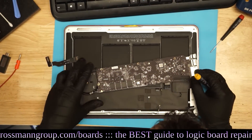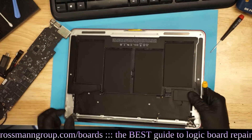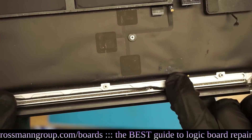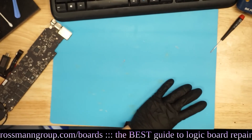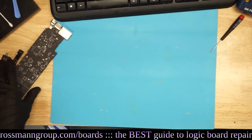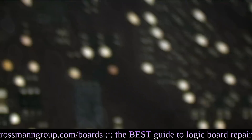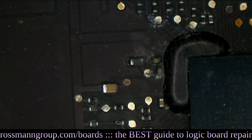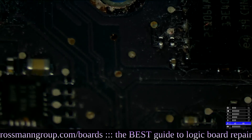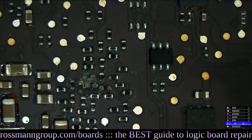Now we have a hint. Can you see my hint? That is liquid damage. We're going to look at that section of the board and see if there is liquid in that spot, because that will give us an idea of what's going on. We look at that spot on the board — liquid! There's water over here by the BIOS, but the traces that are usually broken aren't broken yet. There was a little bit that probably got on my clock chip, so we're going to check that.